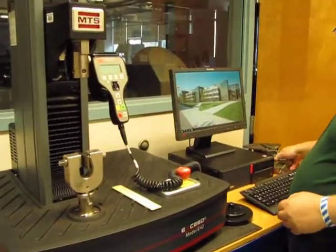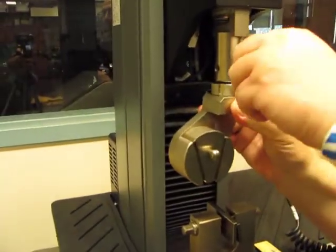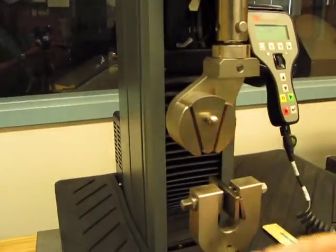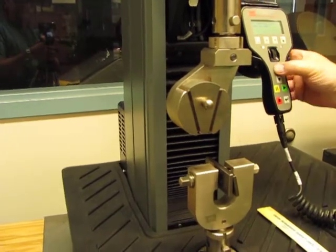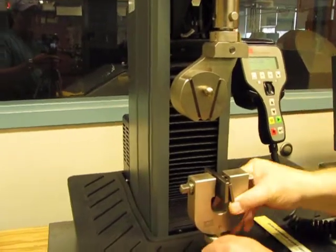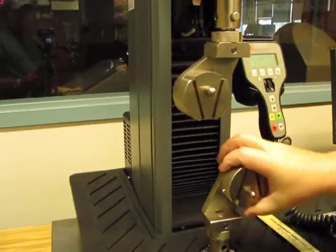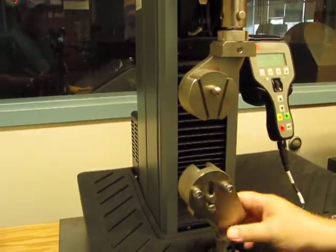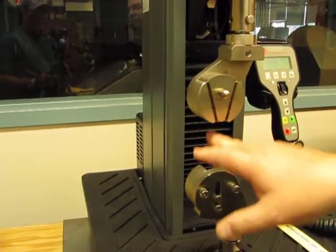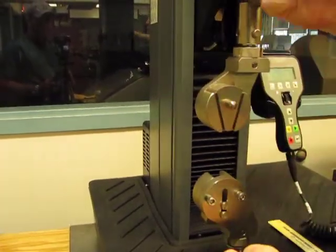In addition to these, we have wire grips, which are used to pull wire — not too surprisingly, the wire wraps around and locks like that, and you have one top and bottom. These are going to be used in the copper wire experiment. The trick with this one is you have to put one of them one way and one the other — it doesn't matter which way — because the whole point is that we are pulling the test piece linearly, not at an angle, but nice and linear.